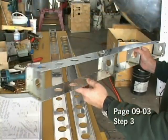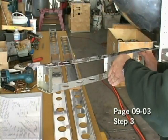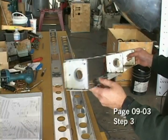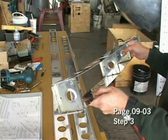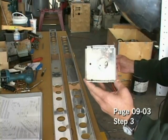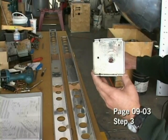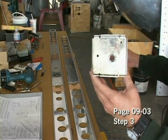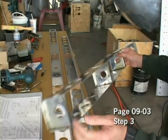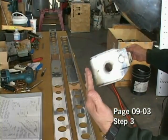On a related note, it's very important to get these square ribs aligned properly so that they are not turned 180 degrees, which is very easy to do. One sanity check prior to riveting is to look down the hole — you must be able to see all the way to the other end perfectly. If you have one of the ribs misaligned, you will find that you cannot see straight down; one side is wider than the other side.